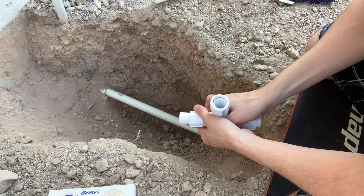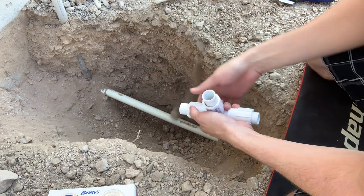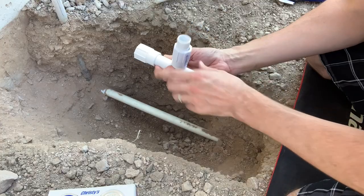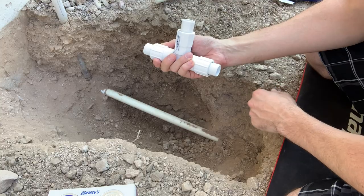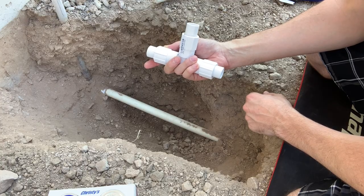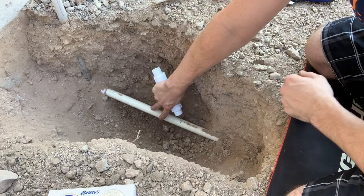Okay, so here's the plan. I'm going to cut into this main line that feeds that box. I have a KwikRepair T with the sliding couplers from Drip Depot. That's gonna make this a lot easier. I'll leave a link for that in the description below, but that will keep me from having to bend the coupler or the T onto the existing line.